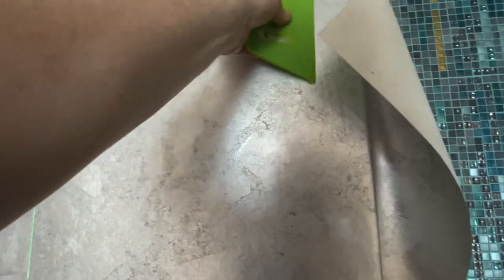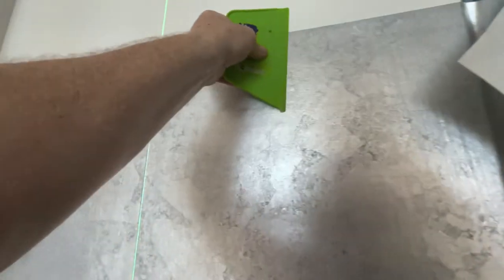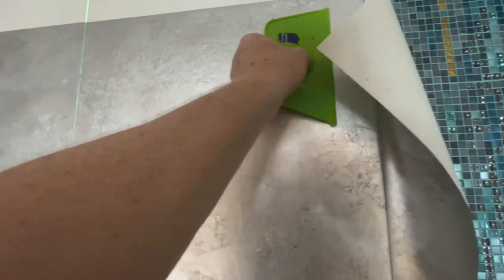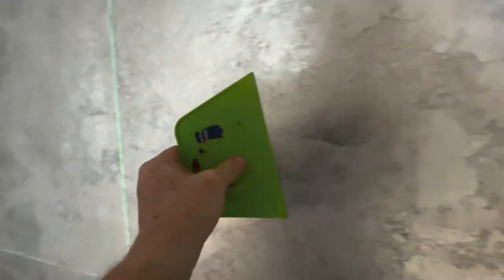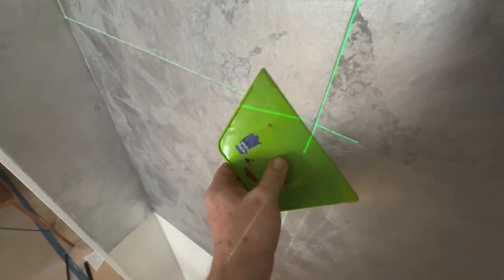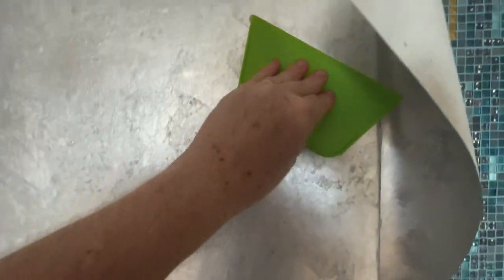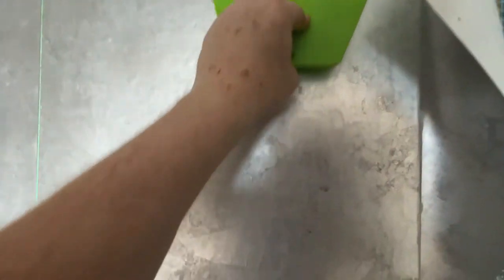You see all the work that gets involved? I'm covering every square inch methodically. What do I mean by methodically? Well, if you just look, you'll see a very planned out passing of my smoother over the product, left to right, right to left. When I come to my corner, look at how I'm going across it. See that? Now vertically, why am I doing this? To push out any lines I made the opposite direction. And we're getting rid of the enemy. Bubbles.